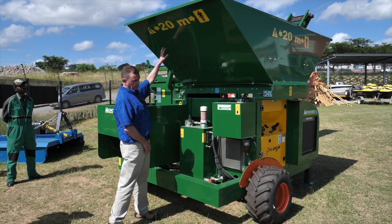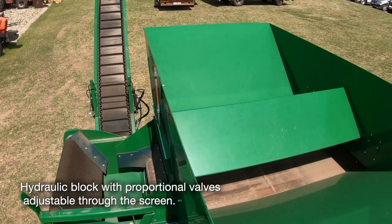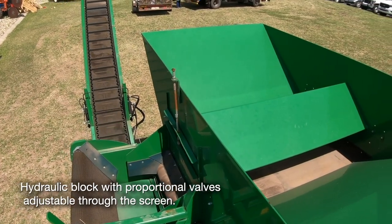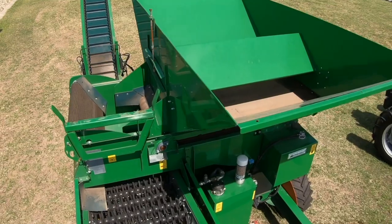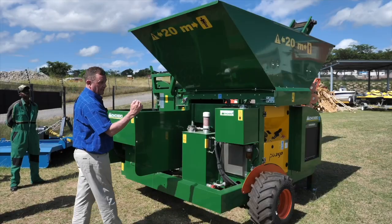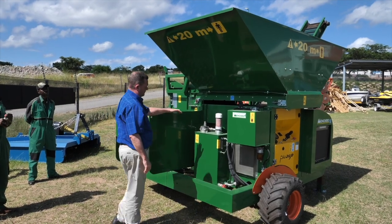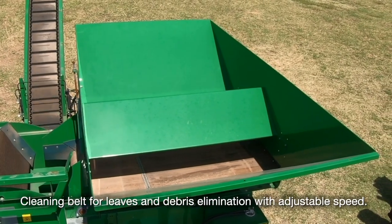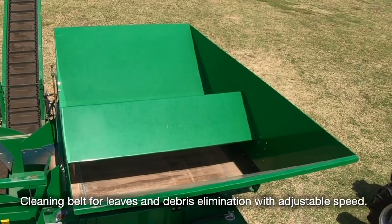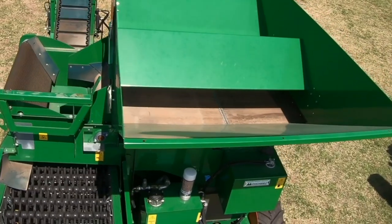This is your main bin here. The farmer will need to feed all the nuts and whatever's been picked up back into the top of the bin. In the top of the bin, you'll be able to regulate how much of the product can actually come out onto the conveyor belt. Here's a feeder conveyor belt with a shoot just underneath that controls how much product you want to put into the system.